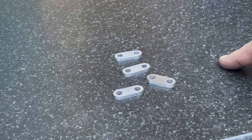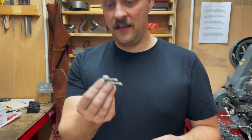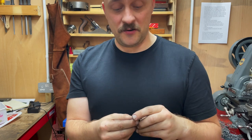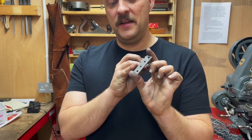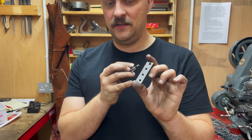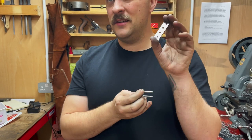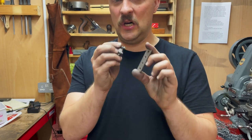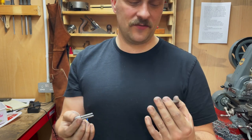There are the spring plates. Now for the springs — an annoying addendum: I tried placing the spring pins and the spring plates into position and as you can see they don't fit. The holes on this are 30 thou further apart than these. That means I need to move these holes inwards by about 16 thou, or increase the diameter by 30 thou. 30 thou is a thirty-second, and this is bang on 3 sixteenths although it was drilled with a number 11 drill, so I should be able to re-drill it at 7 thirty-seconds and that will also give a little bit of play for the spring pins to move in other directions to follow the roll of the track. That's super annoying — I don't know how that happened.